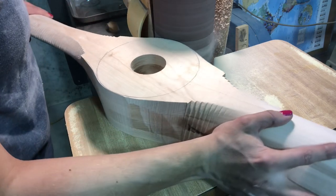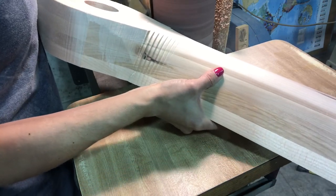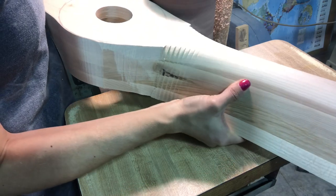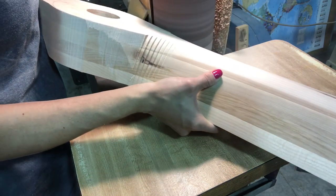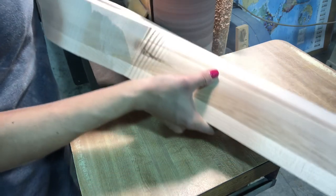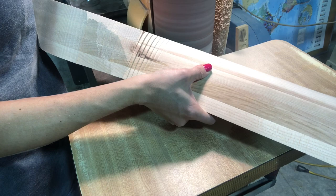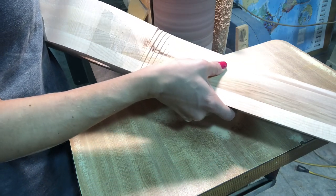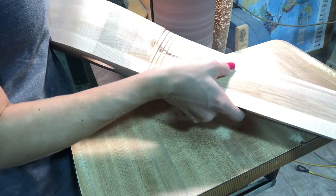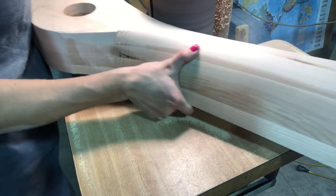That's really the only line I have on it. From there, I'm just trying to smooth it out — take out any gouges, no lumps or bumps. If I started taking out more material than just what it takes to get those lines out, that's when I would start running into problems, probably with my balance. This affects my vertical balance. So if my vertical balance is off, I'll come back and sand the heavy side.